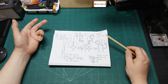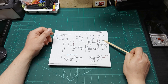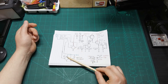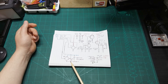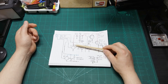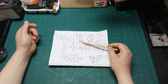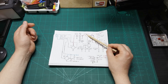Let's have a look at the schematic first. It's really simple but uses triode vacuum tubes — 6N11 and 6N3 — with a transformer that has two secondary windings: one for the anode voltage and one for the heating element. I'm smoothing the AC voltage and powering the heating element with DC voltage smoothed by a 10,000 microfarad 16-volt capacitor. The anode voltage is also rectified with a 6-amp rectifier bridge and a 470 microfarad 350-volt capacitor to smooth it. I've stabilized the voltage using a zener diode, a resistor, and a BU508 transistor to stabilize 150 volts for the anode.